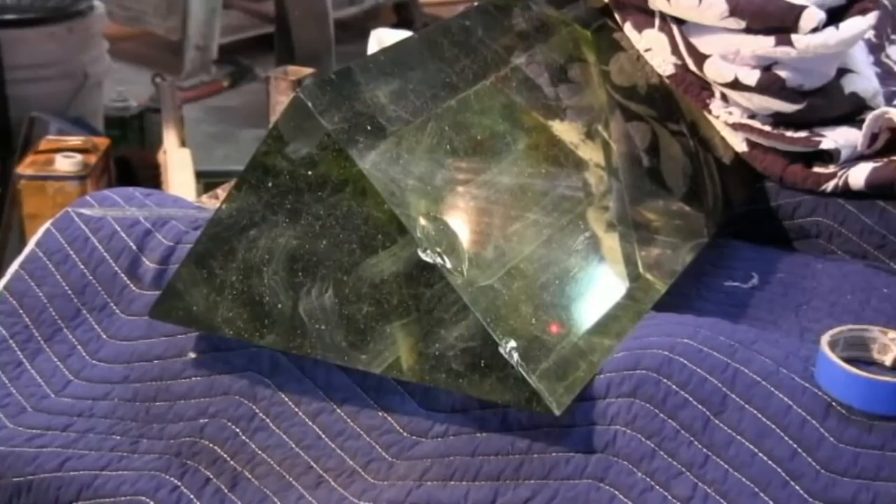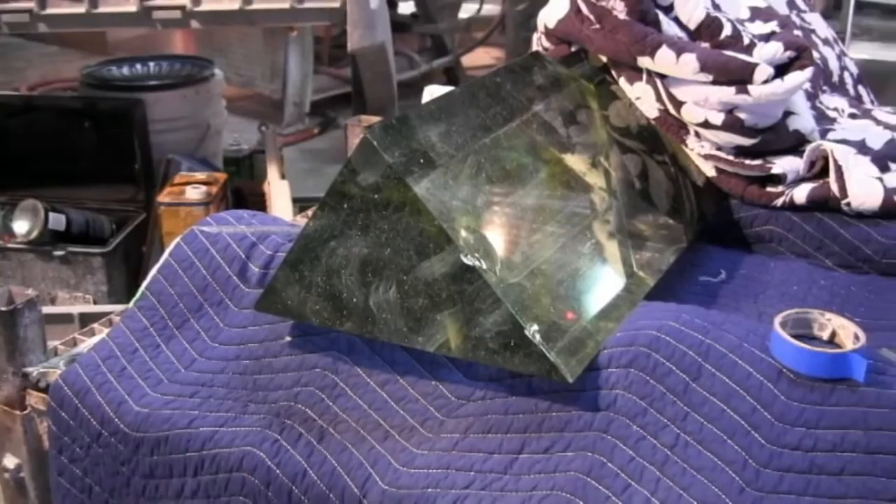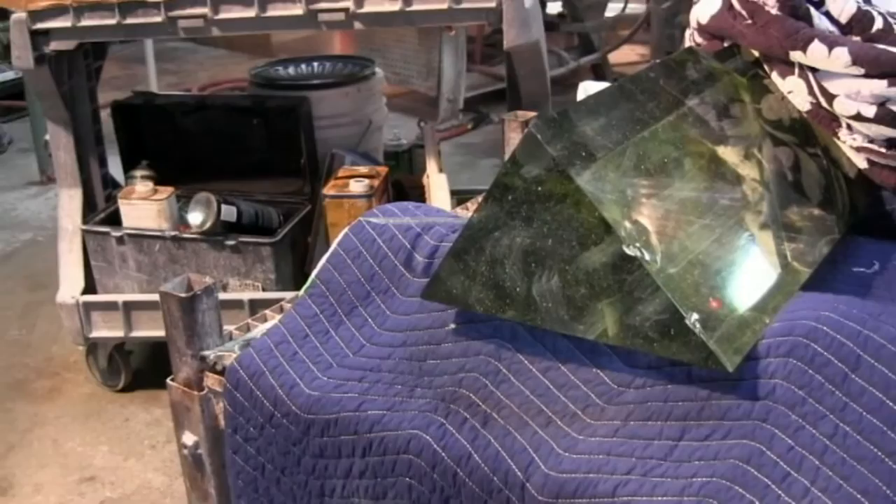When the piece was standing up, it just put too much pressure on this very sharp edge and it pinched. When it pinched, it made these big what we call clamshells — and that's the problem. So when we redo this piece and restore it, we will put a nice beautiful rounded seam on it, like this side right here.